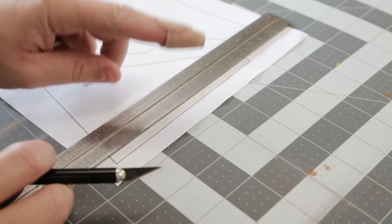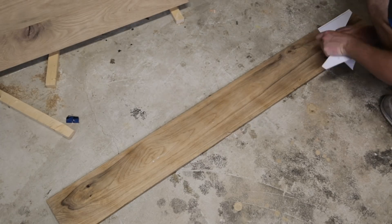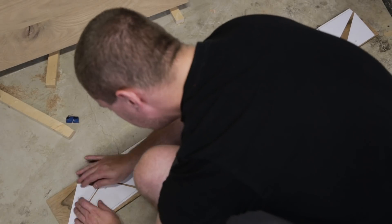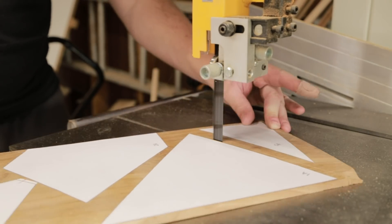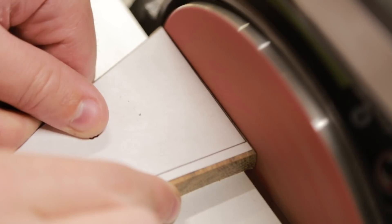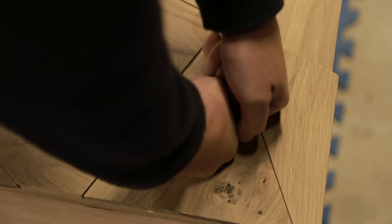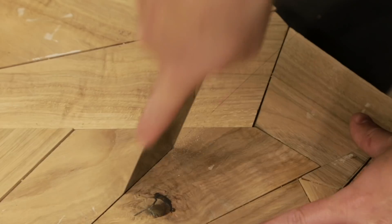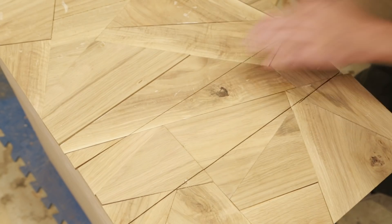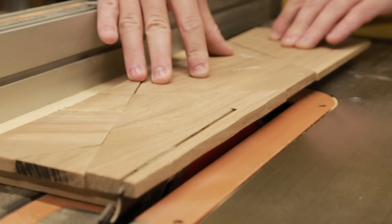Using the most dangerous tool in my shop, I cut some shapes that I made on the computer. Then I used some spray adhesive to temporarily attach these to the board so I can cut them out. While resawing and planing these down, stress was released from the boards so they cupped a little. So when I glued these onto the drawer fronts, I used some CA glue in the middle and applied pressure to flatten them out. The CA glue was also able to hold these pieces while the wood glue set up.